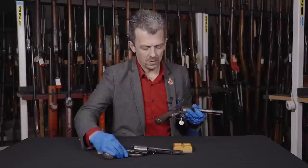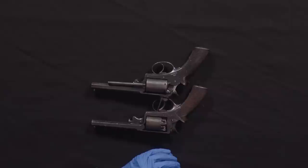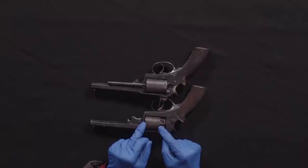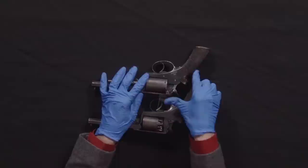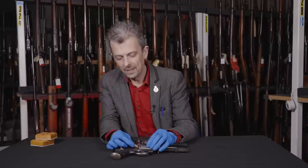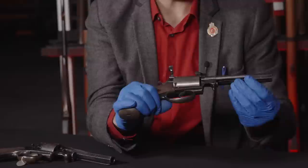Putting these side by side on the table, hopefully you can see the similarities - they are literally the same thing with a few differences. Depending on the production series you'll get some slightly different angles, but there are standardized changes. The cylinder can't really be converted because too much metal has been chopped out of it, so you have to replace the cylinder. The loading gate obviously has to be added to the side of the frame. You also have a deep groove milled here - a large U-shaped channel in the frame - to enable you to insert the cartridge.